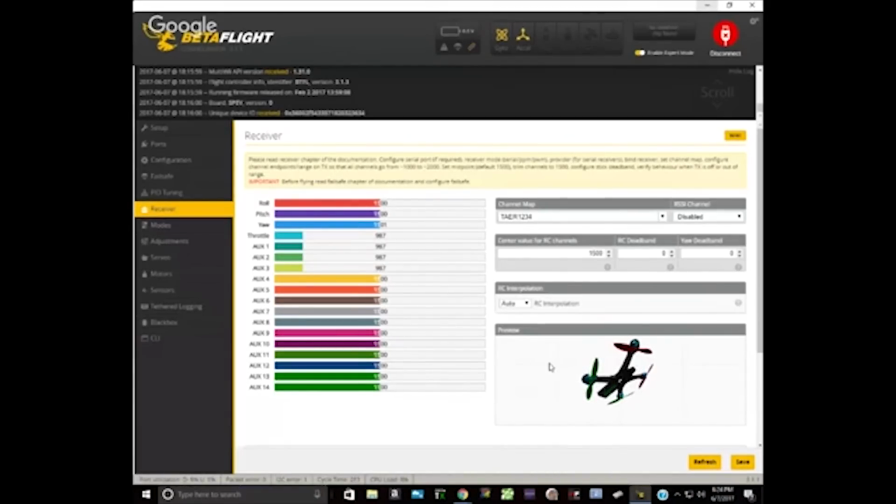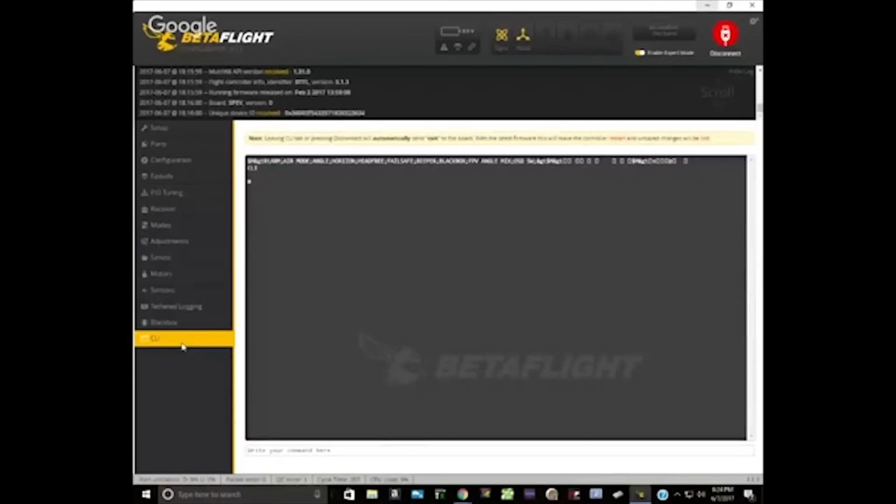Let's check your min check. This has nothing to do with your problem, but I feel like it's another thing I do. Look at your throttle channel right now. It's at 987, right? Go to the CLI and type get min_check. So your min check is at 1100.